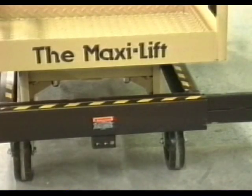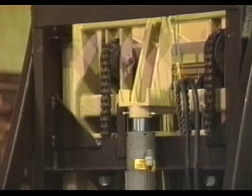The slack must be taken out of the chain by tightening the anchor nuts until the column is just contacting the stop angle on the adjacent column. Both leaf chains on the column must be adjusted evenly to prevent uneven loading on the chains. After adjusting chains on one column, the chains must then be checked on columns proceeding back toward the frame column.